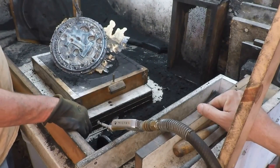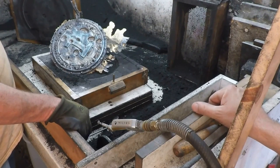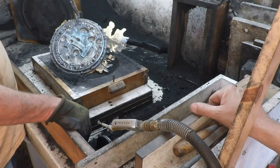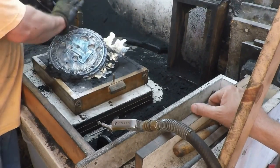The only good part is I will chop this up, and when I get ready to remelt — because I've lost some of the zinc — and I'm looking for that yellow brass, I'll probably add about two dollars in pennies to it so that I get my zinc back, and it'll be yellow again. But there it is.